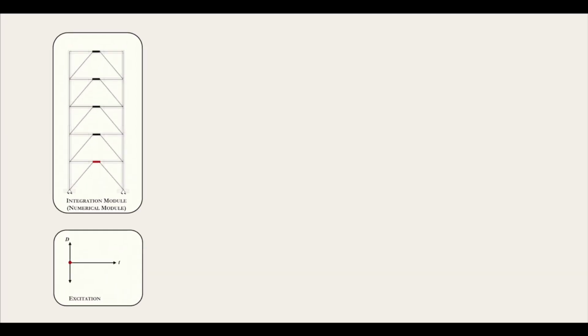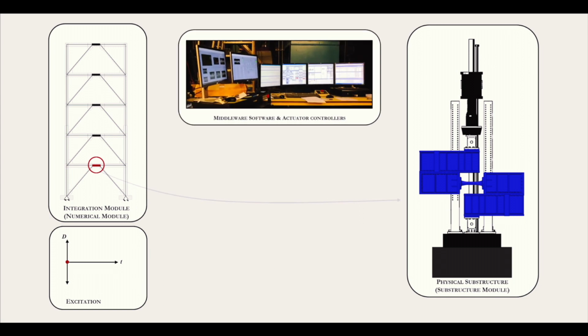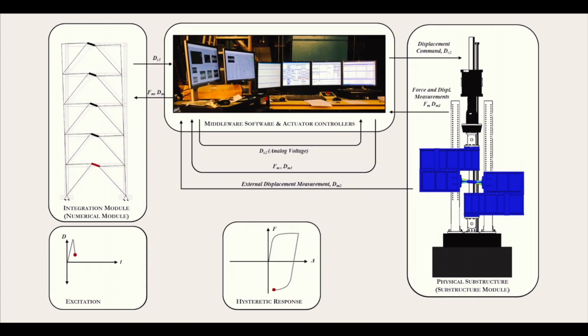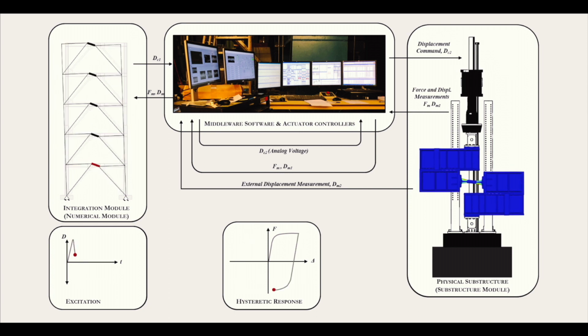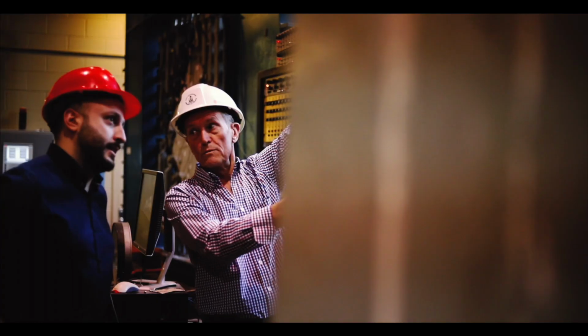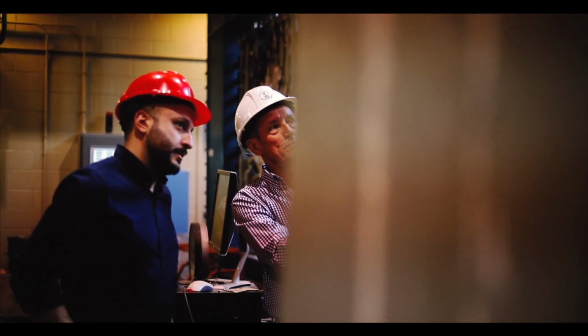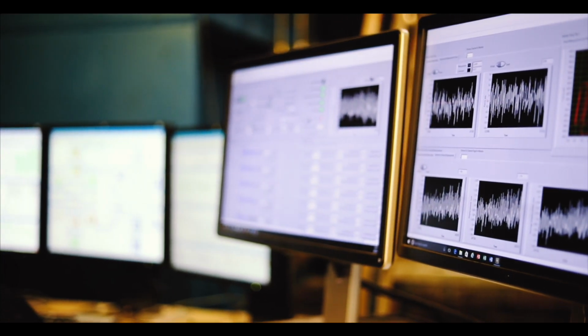One of these experimental methods is the, so to speak, pseudodynamic hybrid test method. Similar to most simulations, in hybrid simulation, most of the structure is modeled numerically, but the critical component of the structure which absorbs the seismic energy is physically represented in the laboratory. We refer to it as the physical substructure. This enables our experiments to have a much better correlation with real earthquakes.